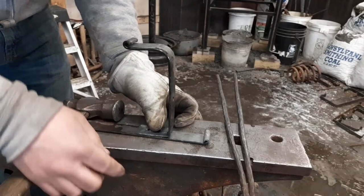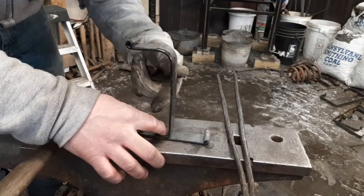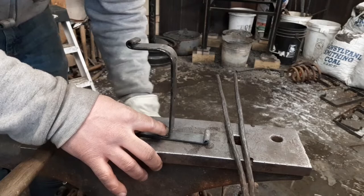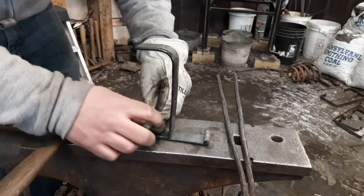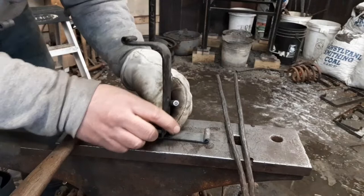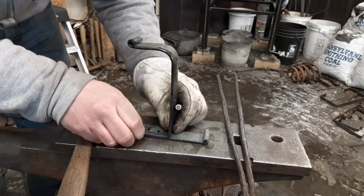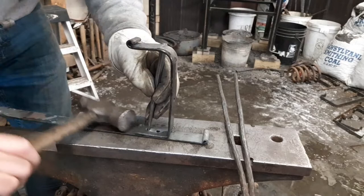Okay, so from your three inch mark on the top of this, you're going to set, just hit the dot, and you're going to transfer your holes over to there. So get your center punch out. Punch your holes, make sure it's good and lined up. Use a marker first if you want. I just generally do this. If you give it a light center punch mark, you can readjust if it's off a little bit. Make sure everything lines up good.